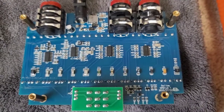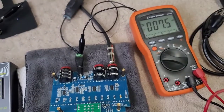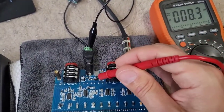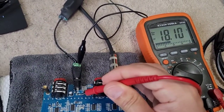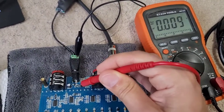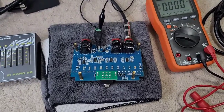This particular version has some issue with the step-up circuitry, which is located right here as I look past the camera. I wanted to show that you can power this with 8.5 volts incoming. Where the up-converter circuitry is, it's actually powering the chips with 18.1 volts. It'll go through a 10-ohm resistor, so it's actually seeing about 16.84 volts. But that's still good — you're still getting the full headroom of 18 volts; it's just doing it internally.